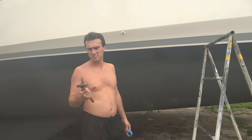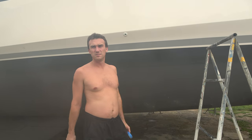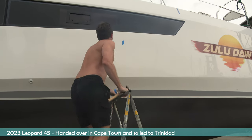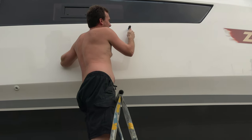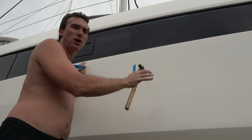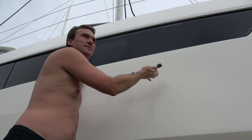To go into a little bit more detail, I've roped Trent in, who's been watching and learning from the JS Marine guys working on our boat. I'm just checking for blisters and dry glass. I haven't preemptively set this up — I've just got here and this is just absurd. Right here there's a clear bubble. You can actually push it in. I'm not tapping the whole hull, I'm just picking out discrepancies. How does this stuff get past QC?